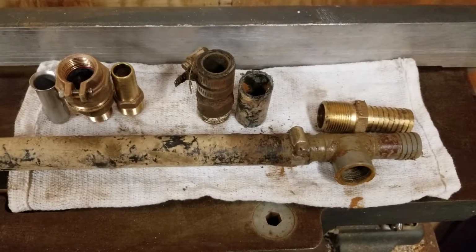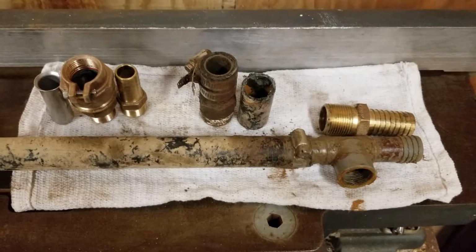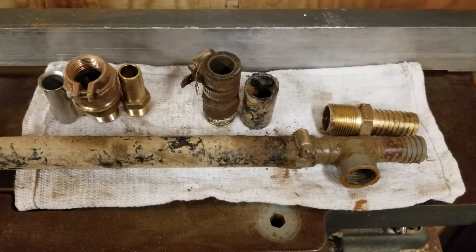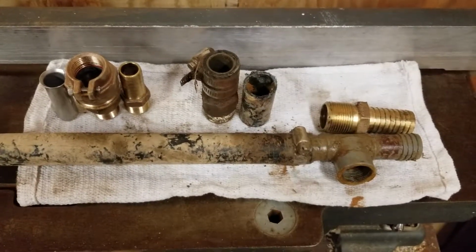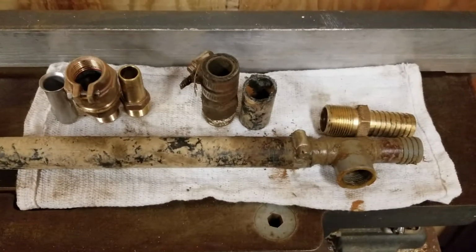So, when you go to put in a sprinkler system, a lot of times it'll tie into the house's water line. And the biggest question is, what is it? You could have copper, you could have a galvanized line if it's an older house. It could be HDPE, like this black tubing in front of me. It could be PEX if it's a newer water line. It could be clear, it could be blue. There's a lot of different options out there.